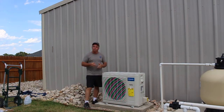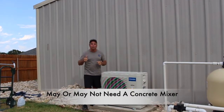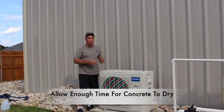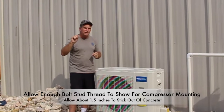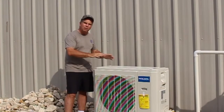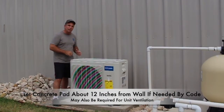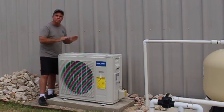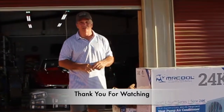The Mr. Cool air compressor is now mounted on the concrete slab. Here are some key points: this job took about five hours to complete, though it would have taken longer without the concrete mixer. Give yourself extra time for the concrete to dry, and make sure when you set the studs you leave enough thread exposed to mount the compressor. Also, set your concrete pad at least 12 inches from the exterior wall to allow for air circulation around the unit. If you like what you see, go ahead and subscribe and leave some comments — see you soon.